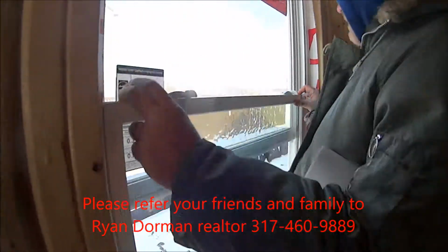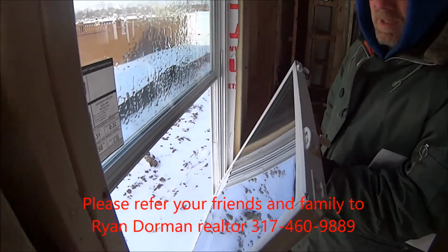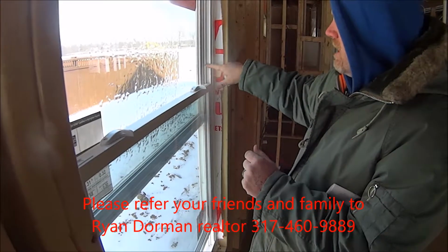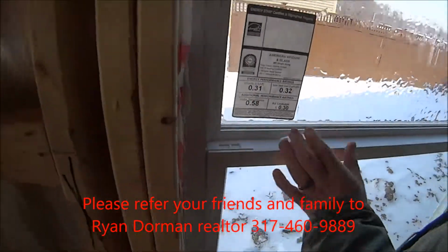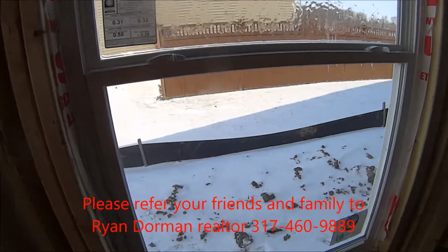You got two little clips here that allow it to tilt forward. We install your screens there when we clean at the end, and you have a little lip there that you can pull it out. When you install these, you want to make sure that these actually engage in this channel here, because otherwise if they don't, they can damage your weather stripping. So you get that locked in, close it down, and lock it up. I'm not going to lock it because the ice in there holds it up.